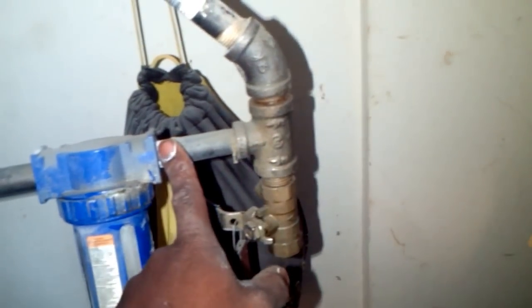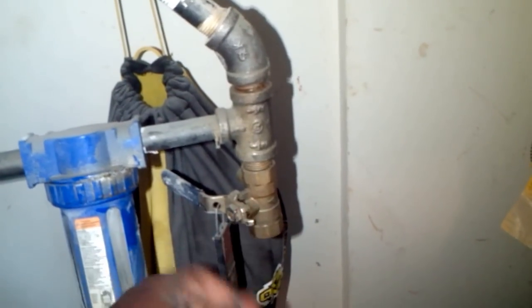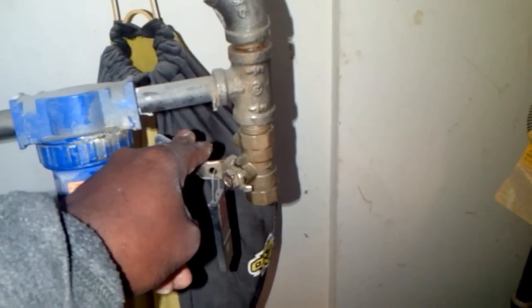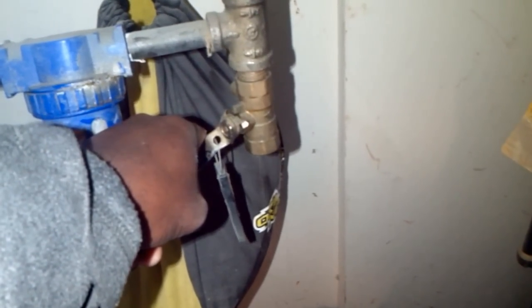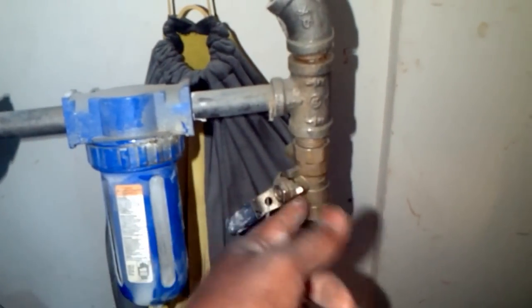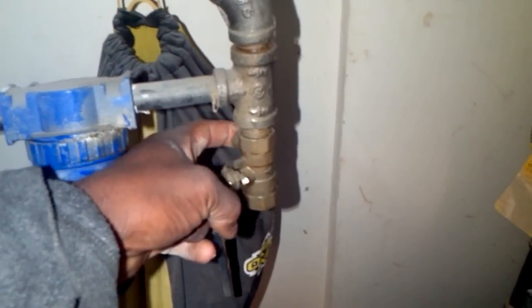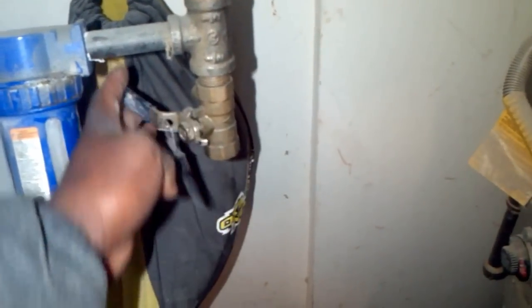So that's where you go from the water separator to your T, and that's where you have your moisture or water that's going to actually drop here. And let's see if I got some from last night. Right on time. Alright. So when you're actually running your compressor, what you always want to do is you always want to let this out. There's actually a blow-off valve right here. But this is the valve just to open it up and let everything out.